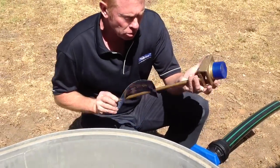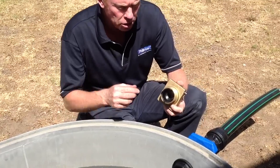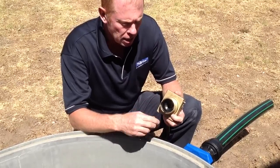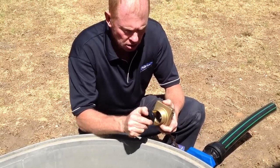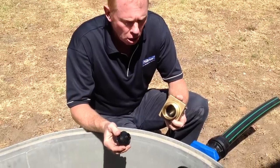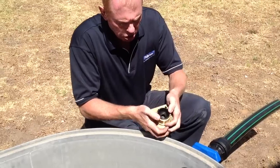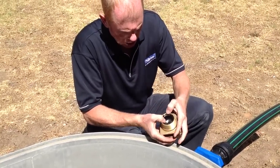That's important because when we remove this blue cap, the valve is now fitted with this black insert. If you're using the low pressure shutoff application, we recommend removal of the insert. If you're using the high pressure shutoff application, the insert should be pushed firmly into the valve using your fingers.